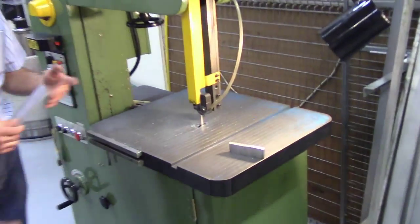Because I'm looking at that, and I'm saying, gee, there's no way that's a straight line. It's very difficult, if not impossible, to get a straight cut with this. Yeah, it's pretty difficult. You really have to pay close attention. And a student should not expect to cut something two-dimension with this saw, correct. So you would then put this in the mill and probably mill that surface down so that it's perfect. That's correct.